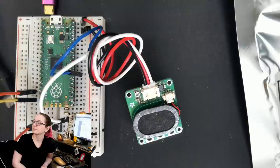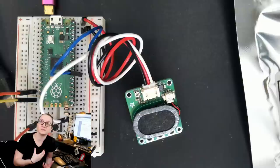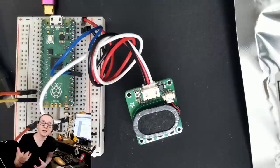Any other questions? Okay. So the dual CDC is interesting because one of the things that I couldn't do with CircuitPython until now is send data between a computer and a CircuitPython board. It's something that's very easy to do with Arduino because you have control over the USB serial connection. But the REPL takes over the serial connection on CircuitPython, and you can't send special characters because they get interpreted as control characters or arrow keys or Control-C.